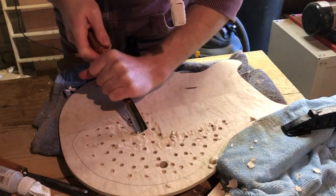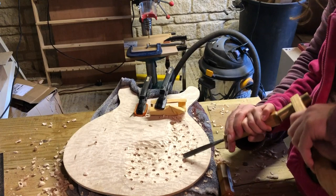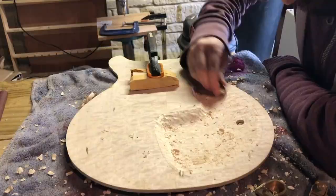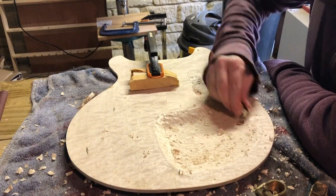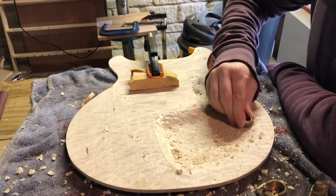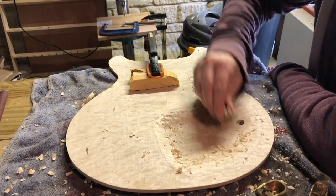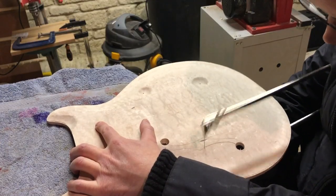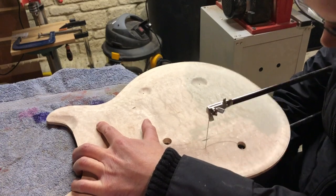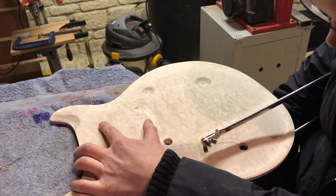Then I flipped the top over and carved the underside — Isabelle came in for a lesson in guitar building. Once I'd roughed that out with a gouge I eventually found my thumb planes and used those. Normally I'd use a thumb plane for all of that because I find it's quicker and easier to cut a concave shape with thumb planes. Once I'd done that I used a fret saw — a 300mm depth fret saw, probably one of the best purchases I've made, about £12.50 off eBay.